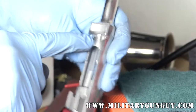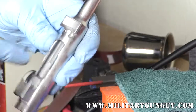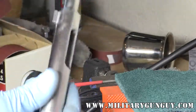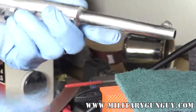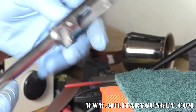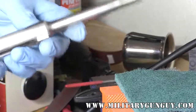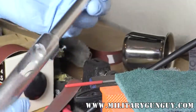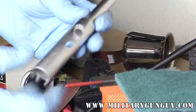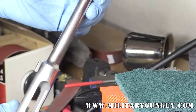This also knocks down the roughness of the bead blasting, so you can see the serial number, which is 662, and there's also a small arsenal mark. Once I polish that out, there's another arsenal mark that was put on these by the Tokyo Arsenal back in the 1930s when these were built. I think that's about it — it needs some final polish, but it gives you the rough idea of how belt sanding carefully and correctly can remove a lot of surface issues in a gun prior to refinishing. You can take something that was pretty thrashed and make it look almost brand new again with time, effort, patience, and careful prep work.